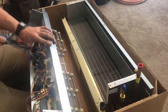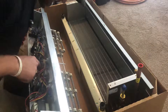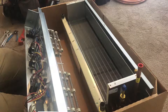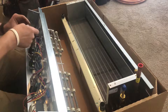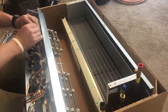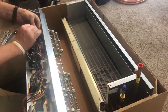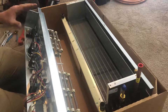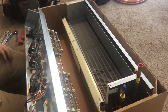And this black wire here. Don't throw the wire away — be nice to the next technician. What I like to do is take the little wire and wrap it around the existing wires, so if the unit ever needs it for whatever reason, we still have the actual wire within the unit.